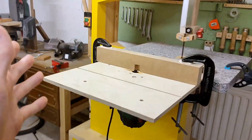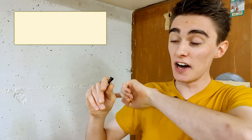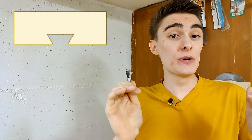I'm going to do that on my makeshift router table. If you know anything about woodworking, you'll know I can't just cut the entire slot in one go with the dovetail bit, or else it would bog down the machine and overheat and dull the router bit, especially in hardwood like Baltic birch. So I have to use a generic straight bit to hog out the majority of the material first in several shallow passes, and only then use the dovetail bit to recut the edges and widen the slot to its final width.